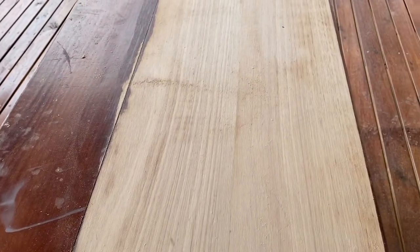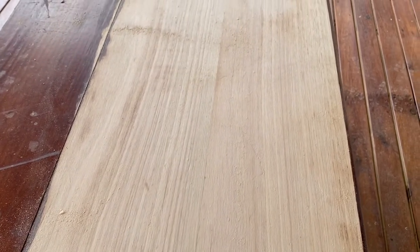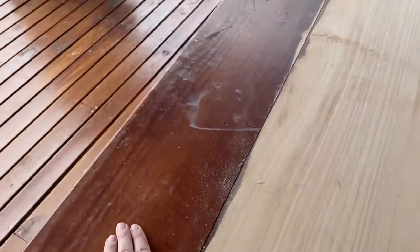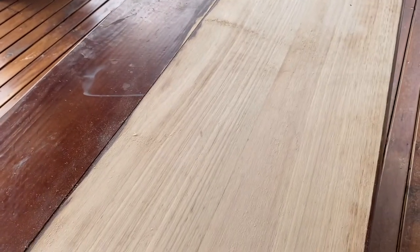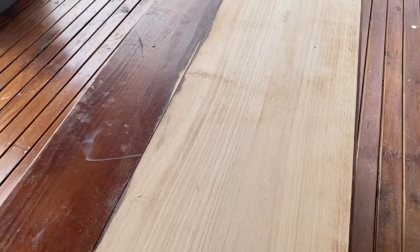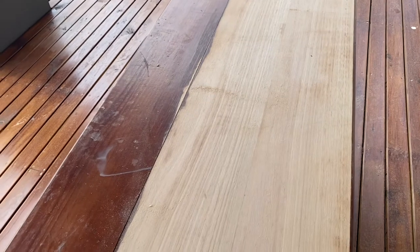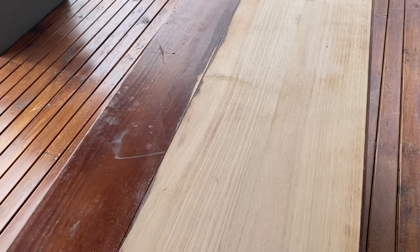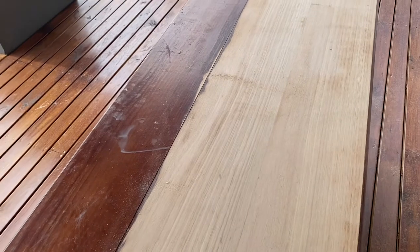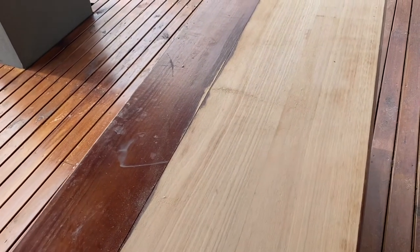I'm going to go over that again, but first I'll finish this piece and then use a softer sanding disc for just finishing it off nicely. Now obviously because it's raw timber, even though it's sanded it feels fairly smooth, it's rougher than lacquered timber. So I'm going to put a clear coat satin finish over the top at the end, which will make it return to having that nice smooth texture and won't add any colour to the tabletop either, so it has that nice authentic timber look which is so popular with the Hampton style.